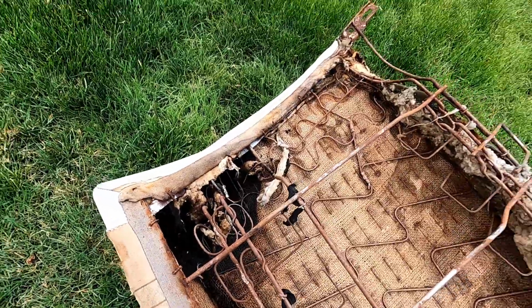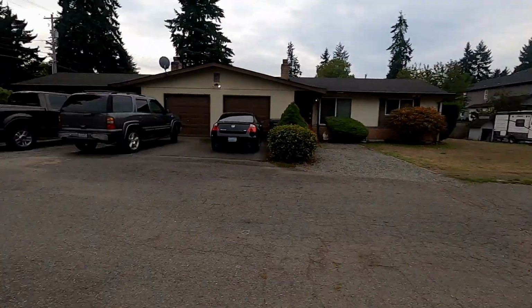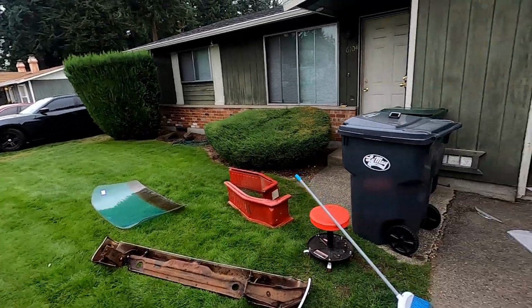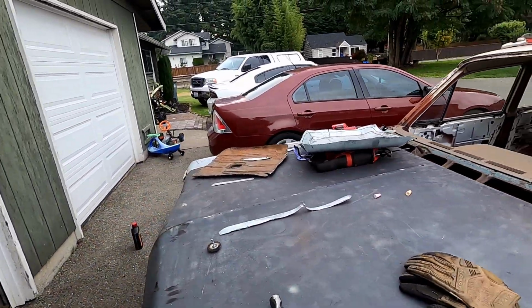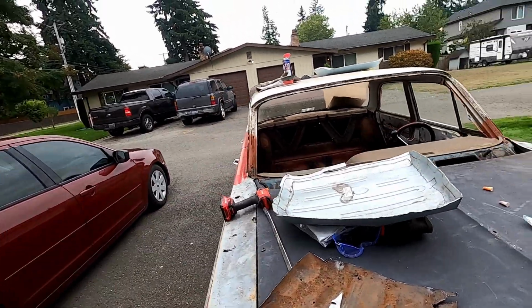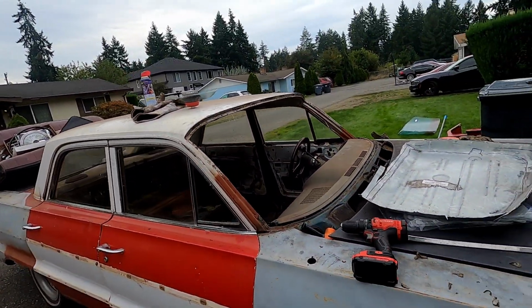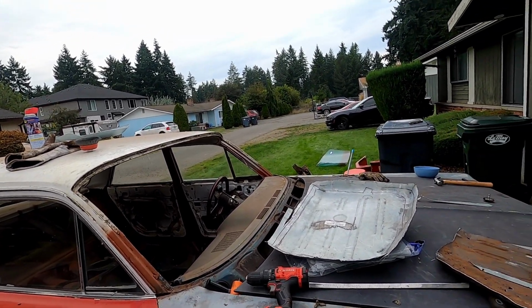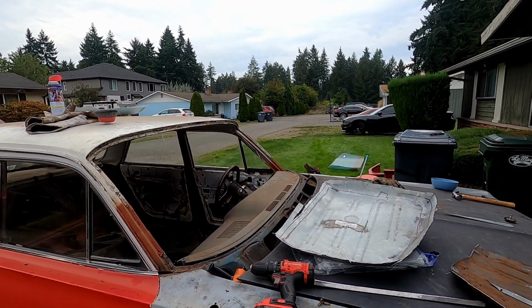Look at that, man. Yeah, the Lexus is over there. It's been having problems like crazy, and I cannot figure out what it is. I took it to the shop. They told me it was a crank sensor. So I was like, you know what, I'll replace the crank sensor. So I took it back from the shop, replaced the crank sensor, replaced the wiring to the crank sensor, started it up, ran fine, but as soon as the car warms up, it dies.